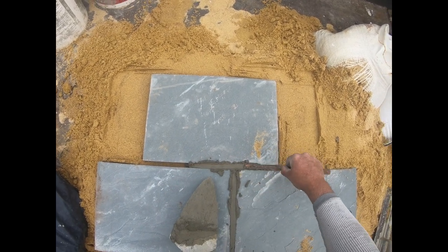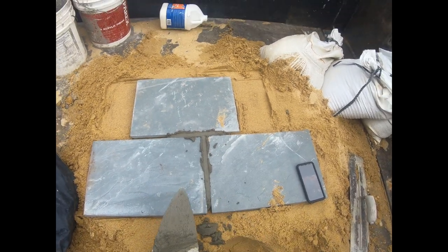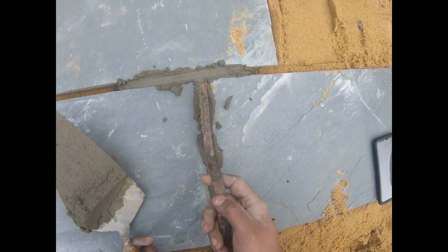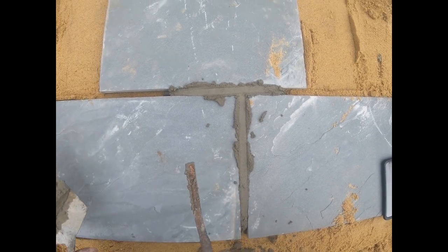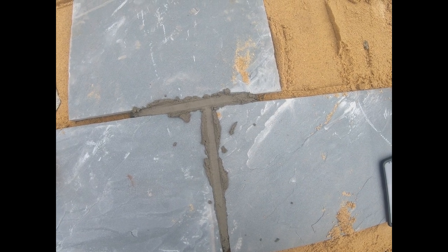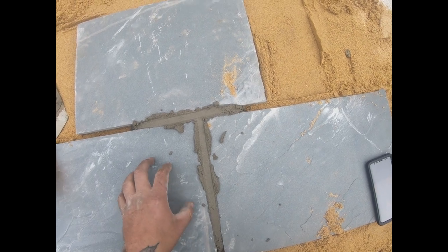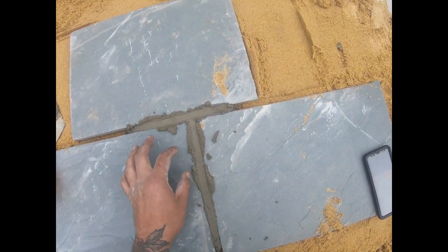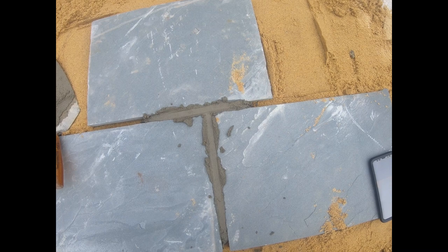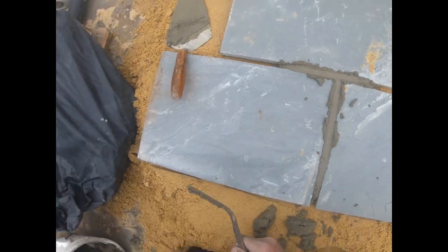You get it all in there, right? And what I'm gonna do, I get it like that first. Let me make sure you got a nice close up. I get it like that first. Don't worry about these crumbs on the edge, right? Because if you try to get those off now, they're gonna smear, right? Plus, you need to let this set up. This stone will start taking the water out of this cement right away. It's starting to do it. So in no time, your joint's going to be a little bit tighter and these are going to be less smeary.